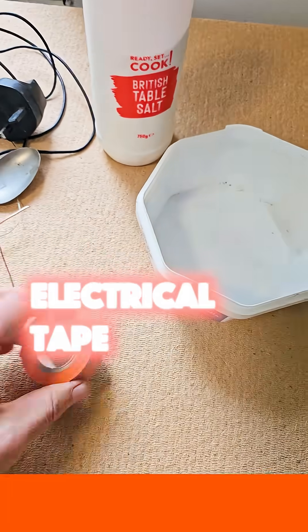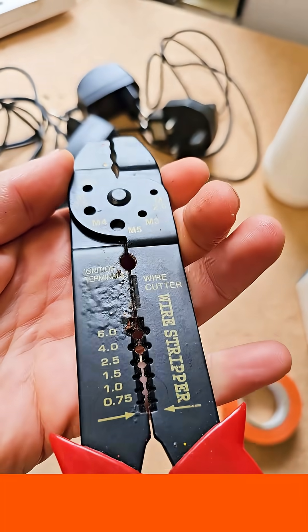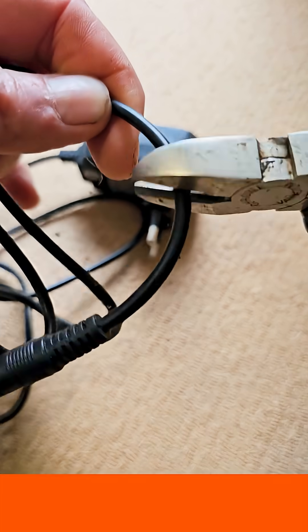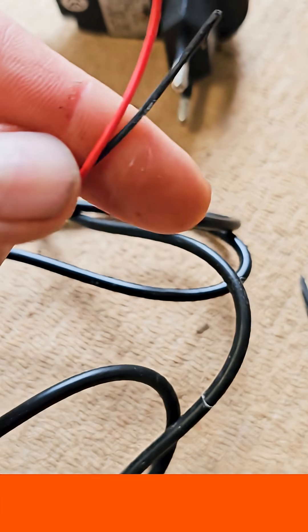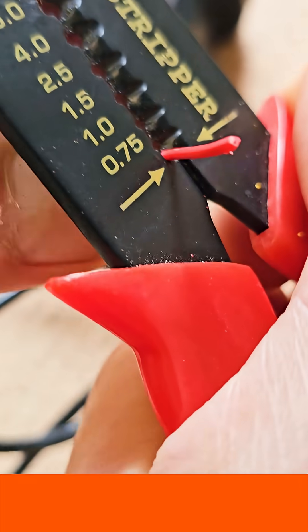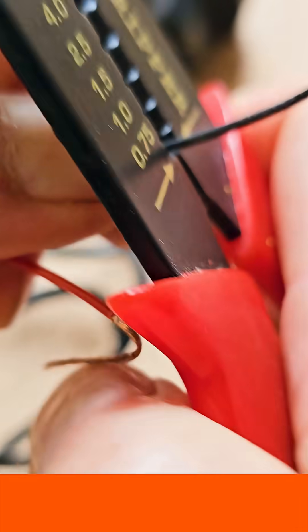You'll also need a little tub and some electrical tape. If you want to strip your wire, one of these wire strippers is handy, but you could just use a stanley knife or scissors — this one is a lot quicker though. Take your old charger and cut the end off, then cut it open to get to the wires. Give yourself plenty of length; once you've got your tips, cut off about an inch at the end, then curl the edges. The other colour might be black or white — in this instance it's black.